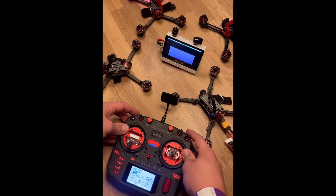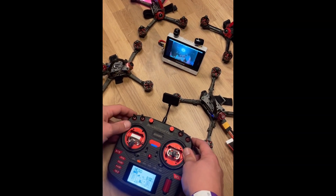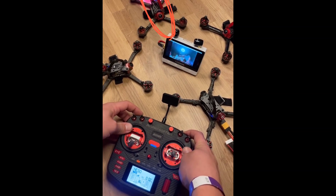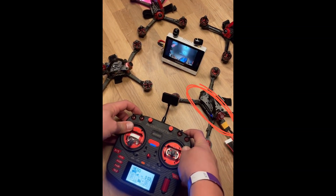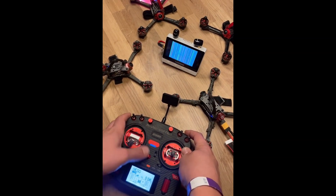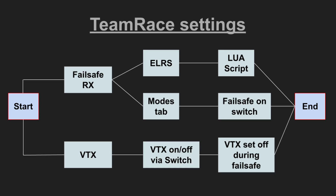The goal is to have multiple copters plugged in and ready to take off, then decide via a switch to fly only copter 3, for example. All others should not take off. The problem is when more than one copter is plugged in, the radio should only control one and video should only be sent by one copter. These are the challenges we tackle now.